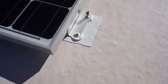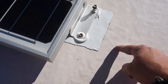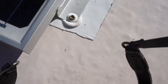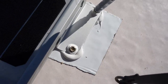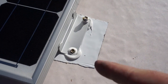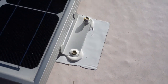For attaching the panels to the roof, I first laid down a piece of Eternabond tape, then drilled pilot holes with a small drill bit so I could get the screws started. Underneath I put some lap sealant, and I coated the screws with lap sealant, then hand tightened them down. I don't want to overtighten because I don't want to strip the hole — I want the nuts to have a good bite. Then I'm going to go over the whole thing with more Dicor lap sealant and may even cover that with Eternabond tape.